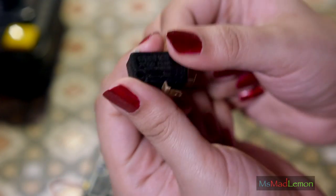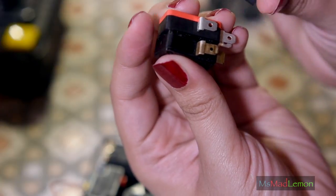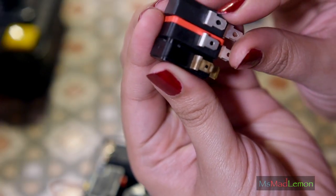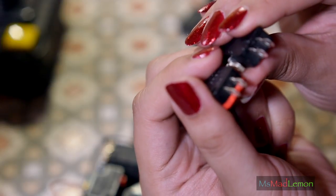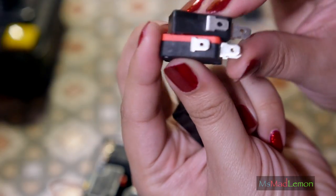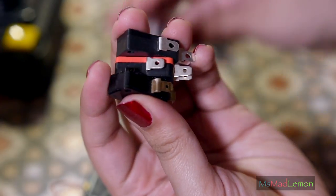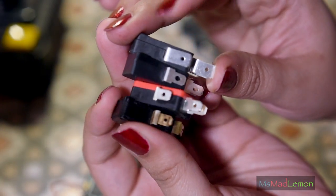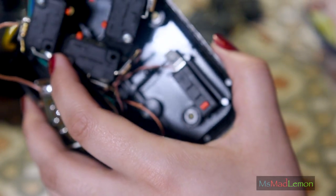So as I said, this is the original. This is some generic one. The spade connectors are the same. The Zippy ones I've just recently bought — I think you can just about get away with these. They seem a bit bigger, but they're around the same size; it's like an optical illusion. It may be a bit of a squeeze but you can get away with it. This other one, however, you cannot. Just be mindful of this when you buy microswitches, and also be mindful of the quality — not every switch is the same.